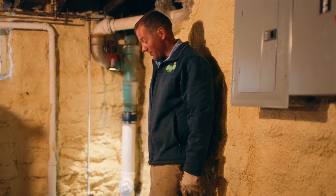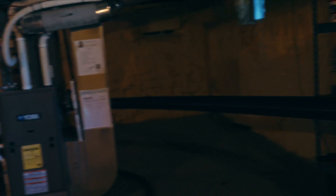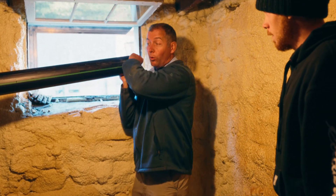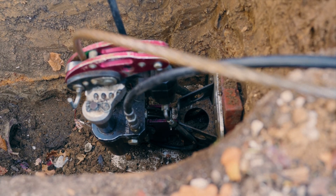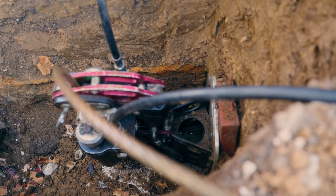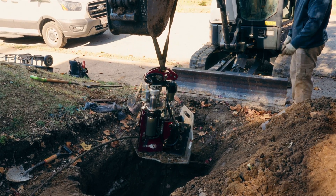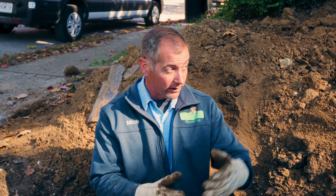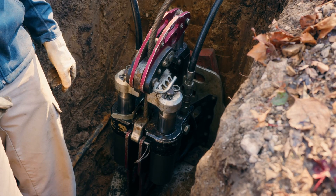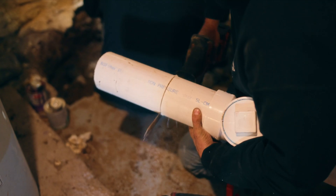You can hear it crunching out the side. We're in. Now I can actually keep it off the furnace by pushing it — at length it's really flexible and it's really strong. We got it. Now we're ready to lift this machine up and out of the hole and get the bursting head off. We have to let this relax for about 30 minutes before we really start hooking up to it, because we've put this pipe through 60,000 pounds of stress. It's a little stretched at the moment, so we're going to let it sit for 30 or 45 minutes, let it relax and go back to its natural distance. Then we'll make our connections on both ends and backfill both ends.